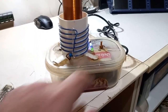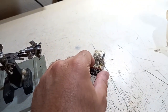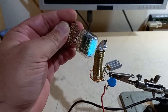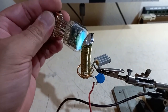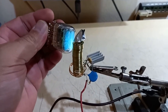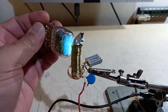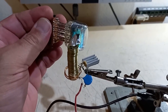But if I turn on this high-frequency Tesla coil, the same Nixie tube glows with this color instead. This is not the first time I showed this on my channel, because I've made several high-frequency oscillators and similar things. But this color is due to neon at high frequency — really high frequency, high voltage — it makes this pinkish, purplish color instead of orange.